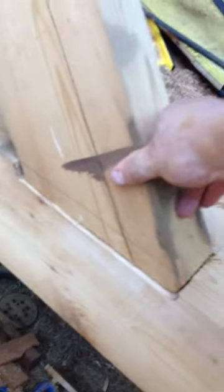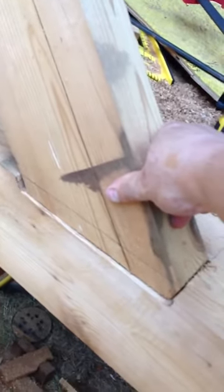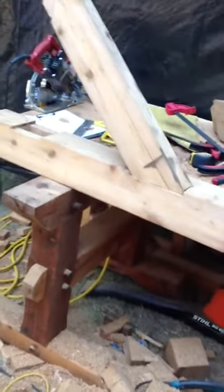the knee brace goes in here like this, mortised, and then at a 45, and it's housed at the same time. Let's see if we can focus it in here. So it sits just like that, and then it's pinned right about, can't really show you, but right about here, pinned, or you could put two pins of maple. And I'm going to back off so you can sort of see.